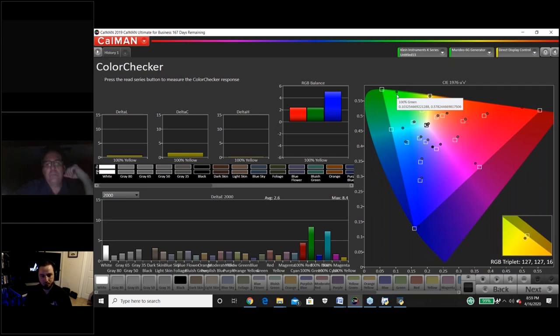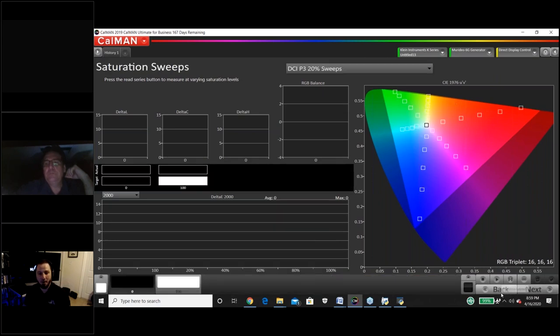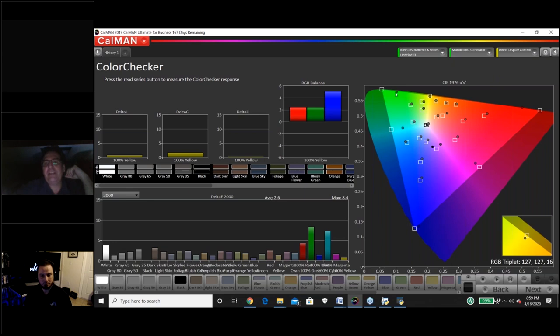Again, the same thing with cyan. Cyan is a delta E of 7 or 8. And if green doesn't go out that far, cyan can't go beyond that line. It's funny too, because if you draw a line from green down to blue, it goes right through that cyan dot, so they're at least lined up correctly. Exactly. It's nice linear performance this way.